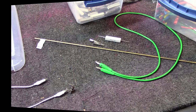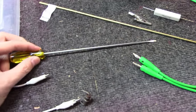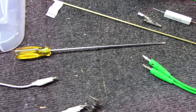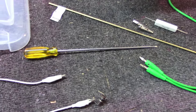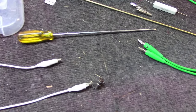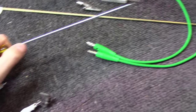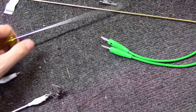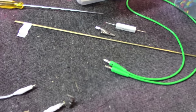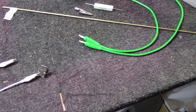My first ever device — it's nothing more than a long screwdriver, and this was in the late 70s. I had no formal education on electronics and I was working on a lot of high powered RF amplifiers. You would simply take this and short the back part to the chassis and go down and short it on the capacitors. You'd hear a big pow, burn a mark, etch a mark on the screwdriver, and sparks happen.